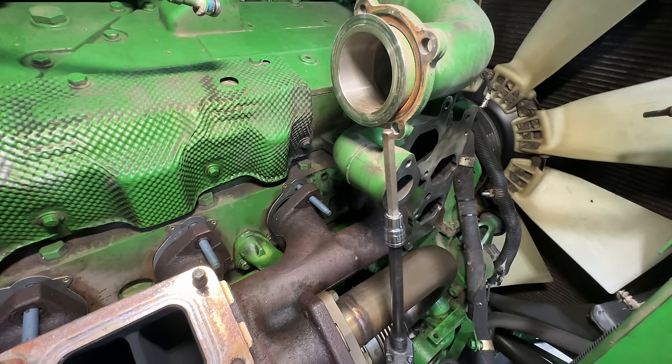All right, showtime. Coolant level is full, and I'm gonna key it on, prime the fuel system, and then I'm gonna start it up, let it run, check for leaks. Probably gonna see some smoking around the exhaust manifold, and you know, that's just that penetrant oil burning off or whatever. But main thing we're looking for: fuel leaks, coolant leaks, oil leaks. Watch that.